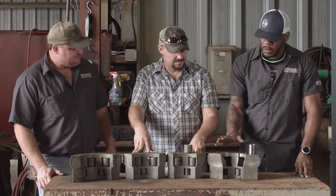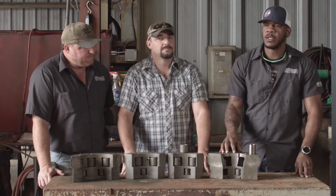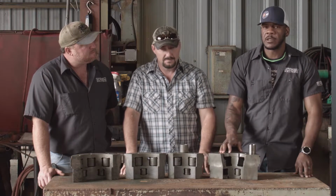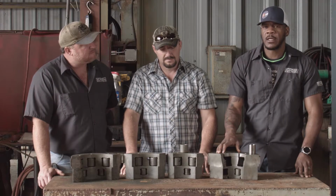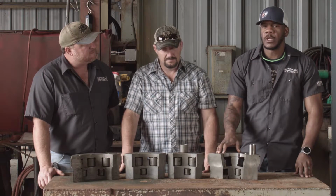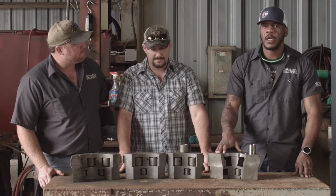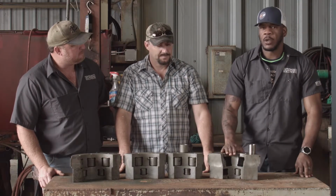This was developed to simplify running tubing. It's kind of how we started. If you've been on the rig floor and you've watched tubing being made up, especially with a single joint, you've probably witnessed 3 or 4 guys with either strap wrenches or chain straps walking around the rotary. Because of this almost frictionless system, 2 or 3 of those guys can go away. So you reduce your personnel exposure down to 1 man being able to walk this in place.